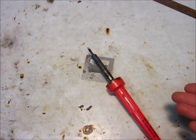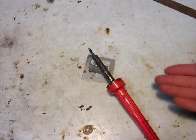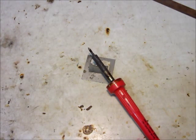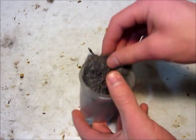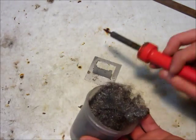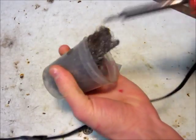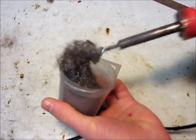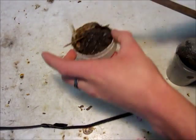If you use your iron a lot and you have it sitting for like five minutes when it's on, it's going to corrode over and you'll have to redo that. So what you can do is — I have this plastic container of steel wool — every few minutes just take off most of the corrosion that's on there, going like this a few times, and then stick it in the flux again.